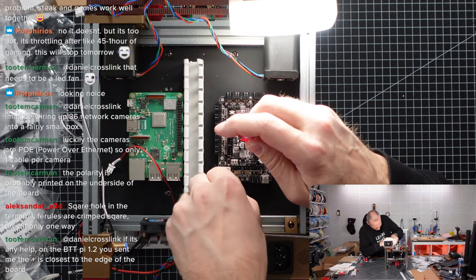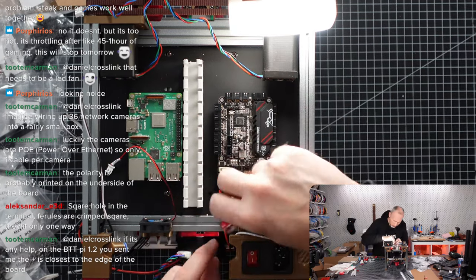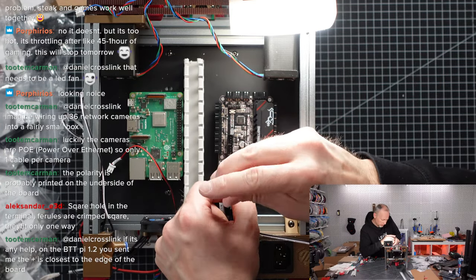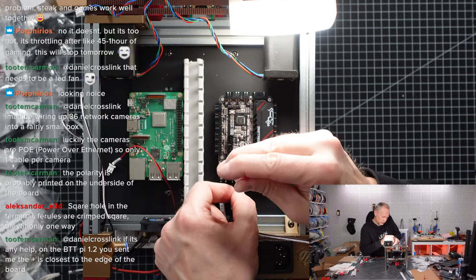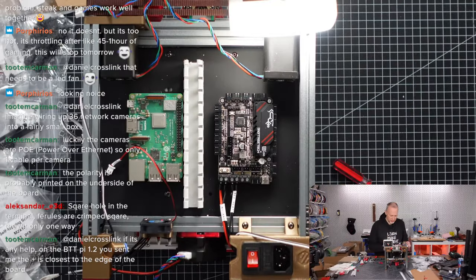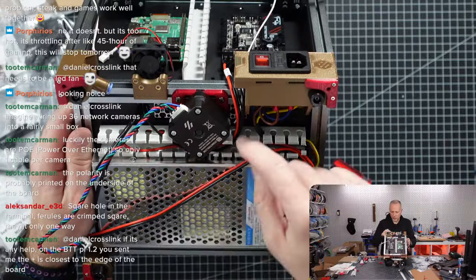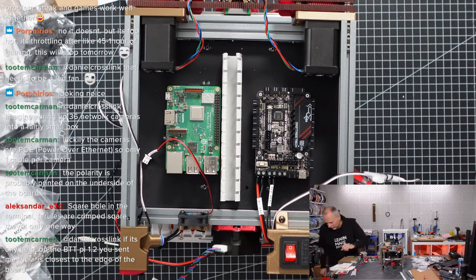These are also very thick pins that they used. So you have to go straight, and they're also, in my opinion, a little bit too long. They're sticking out quite, probably half a millimeter or something, or maybe even a whole millimeter, from these terminals. But now, see, we have a bed heater cable. Also have that running. Oh, that was my light. We go into the channel. We have this loop already for the power cable, but we can store stuff in the channel quite cleanly and run the cables so nothing is interfering with anything.